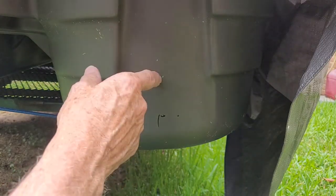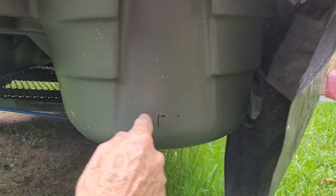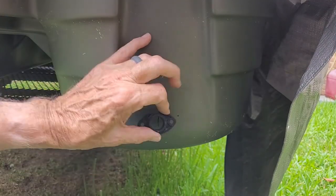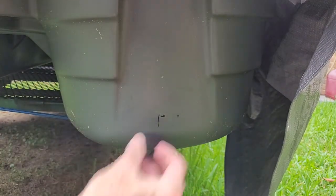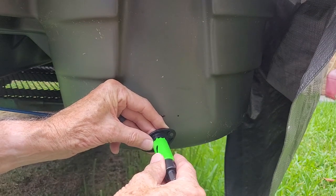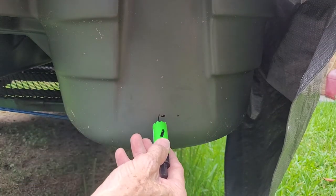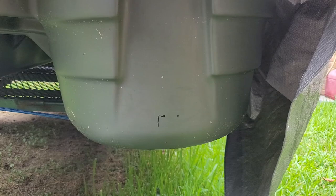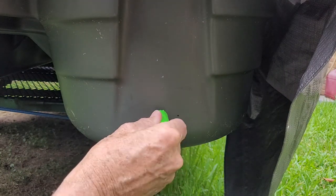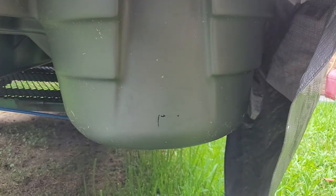Here's where this little plumb bob comes in. I'm going to come up here and find the center of my boat at the top. So now I've found the nine and a half inches down — the center of the boat is right in there. Now the closest hole saw size to this is seven eighths, which is going to be slightly undersized, but I'm going to drill right there with a pilot hole, then come in with my hole saw and drill the hole just like that.